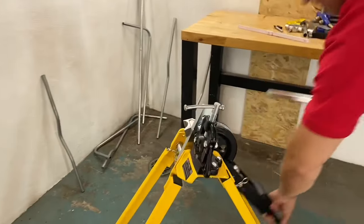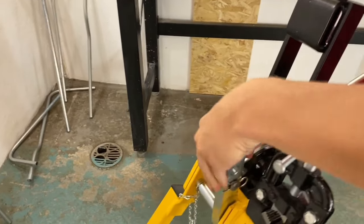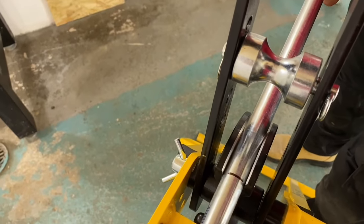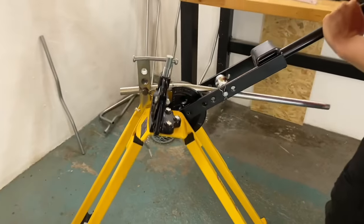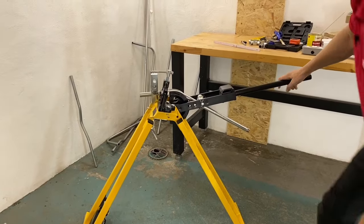Okay, so let's see where you set that into the conduit bending machine. So under the stop and that line needs to be there. So it's the first part of the former because it isn't a crucial measurement. We'd obviously be cutting and threading that in the future. So pull this one now, not to 45, to about 30. Yep, I'm quite happy with that.